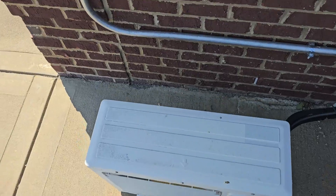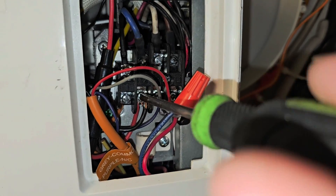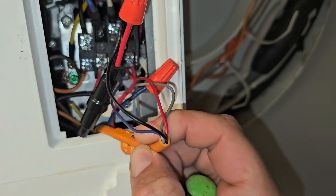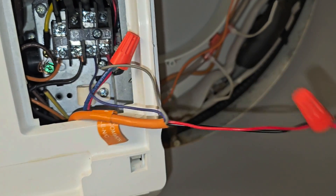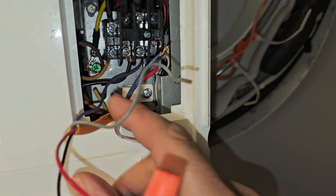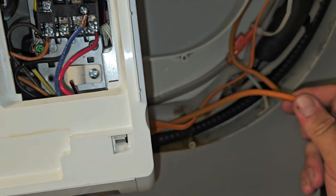Make sure you turn off the power before you replace the pump. Now we're going to disconnect the wiring. If you're unsure about the voltage or power to the unit, check with a meter — make sure you don't have voltage. There's one side of the power and the other side. Now disconnect the gray wire and then the purple wire. There's the power for the pump. It also looks like there's been some damage on the load side of the terminals — L1 and L2 look burnt.